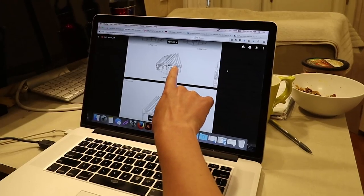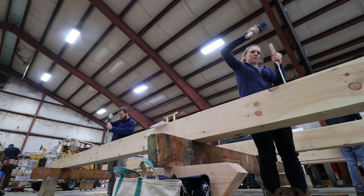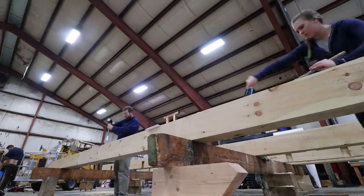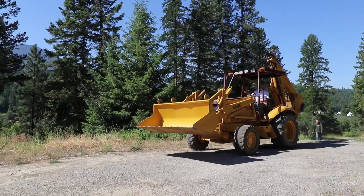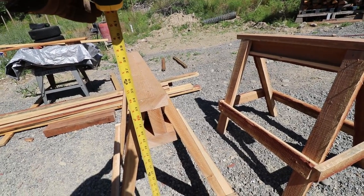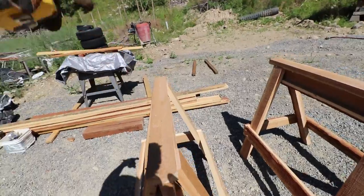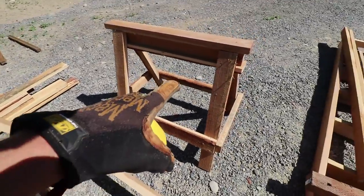The reason we needed to start building sawhorses is for our timber frame home, which we're working on this year. I needed a really simple design that other people can mimic because we're probably going to end up with around 30 pairs — maybe that's too many. You could do this build with screws, but until we got this nail gun recently at a fantastic estate sale, we used screws — with the nail gun you can go really fast. Our backhoe did show up so now I've got to deal with that. Total height on these sawhorses is 34 inches — that might actually be a bit tall, because we're putting big beams on here that'll be maybe 10 inches. When you're trying to do joinery and hog out a mortise, that's pretty high, so we may end up building some shorter sawhorses for the bigger beams.